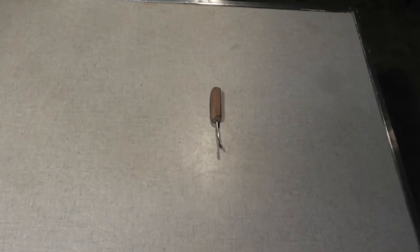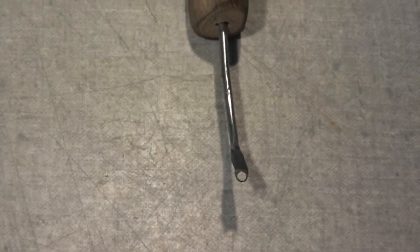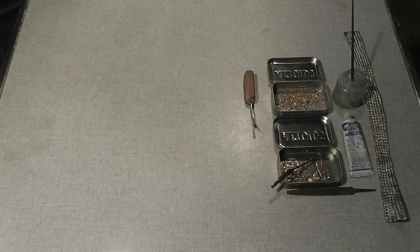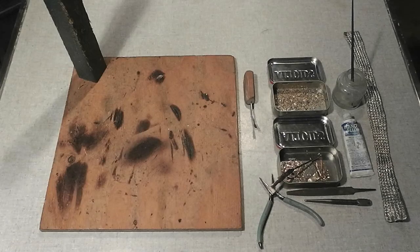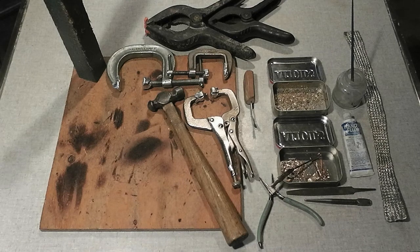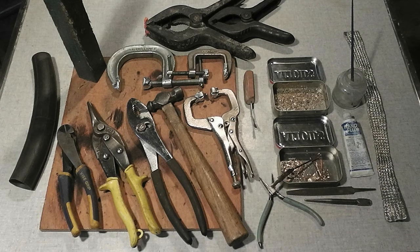There are various tools used with the pit welder. The most necessary tool is this little doodad used for moving pellets into place. It's fabricated from a piece of wire flattened on one end and drilled and ground to make a small ring, then bent to make it easy to use. Other tools include: diluted flux, pellets of all sizes, flat filler material chips and strips, a file to keep the tip clean, a pointed punch, small jeweler's pliers for handling pellets, a piece of plywood with a wood post for holding things steady, plastic clamps for holding the workpiece, a variety of clamps with aluminum facings for clamping the power cables, a small hammer, pliers, metal shears, side cutters, and a piece of bicycle inner tube for insulating the unused bottom cables.